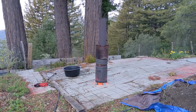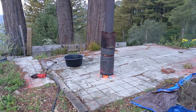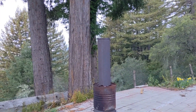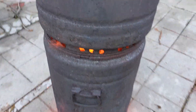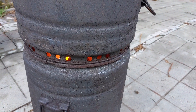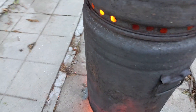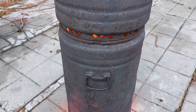There's the unit from a distance — it's got that nice glow on the bottom. The flame front is well and good at the bottom and it's been cooking all that carbon down there. Still nice and clean at the top, just heat waves coming out. I think we're getting close to that transition point. You can still see the top of the material in there, flame color has shifted a little bit, still got one pocket of bright orange and yellow. So I'll wait a little bit longer to get the best quality out of this burn.